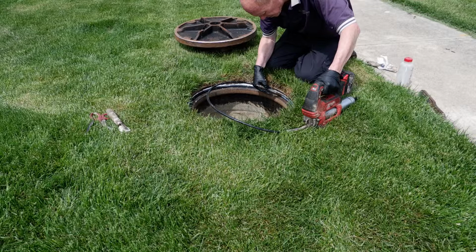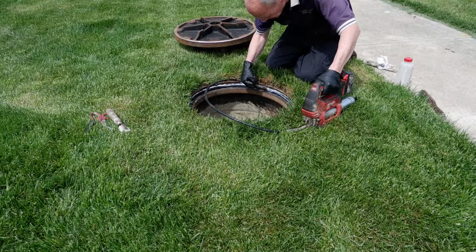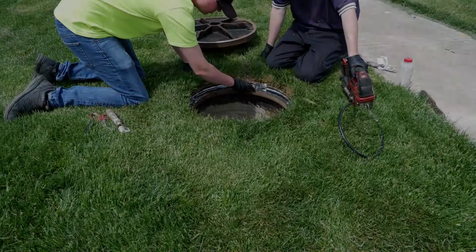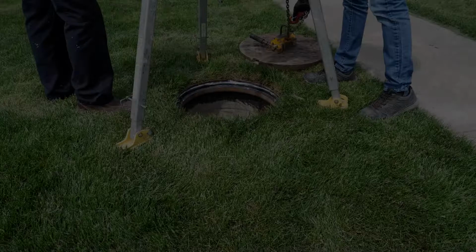Before the cover can be reinstalled, a layer of grease needs to be applied to the front side of the rubber. To do this, use a grease gun to apply a large bead around the frame. Then spread the grease evenly over the rubber using a simple scraper. For best results, allow the seal to cure for up to 1 hour before reinstalling the cover.